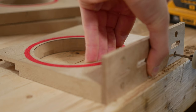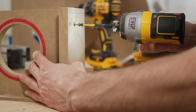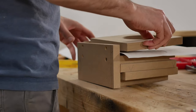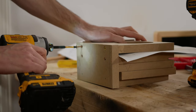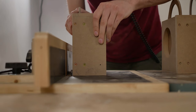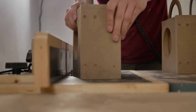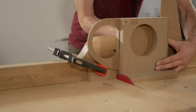Then I can drill the rest of the holes and screw it all together. I used a single sheet of paper to add a little bit of clearance for what felt like the right amount of friction between the gate and the sides. Back at the router table I could flush up the excess material from the brackets, and finally I could round over all the corners.